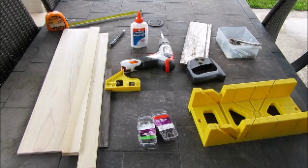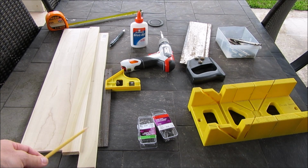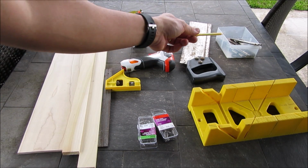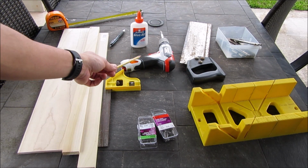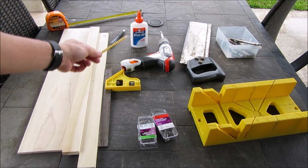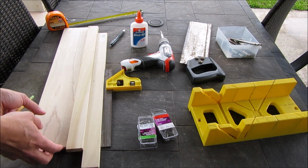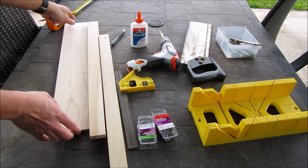What we are going to need are 3 pieces of lumber that you can easily find at your local Lowe's or Home Depot. I went to Lowe's and bought 2 pieces of 2 inches by ½ inch by 2 feet finished poplar wood and a 6-inch by 1/4 of an inch poplar project board for a total cost of $7.10. Now, I don't have a table saw and I don't saw straight, so I will need a miter hand saw, power drill, combination square, tape measure, wood glue, and ½ inch brad nails. I will put in the description below the materials and tools that I used for this project.